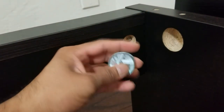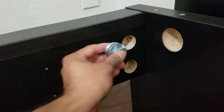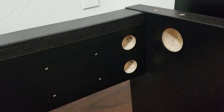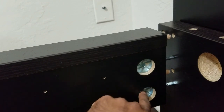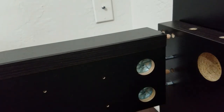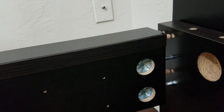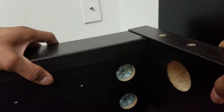The next step involves the pinwheels. The way you need to put them in is with the arrow facing towards you, and they need to go flush in. The arrow should line up with the screw right there. This is the arrow, and it is going to be lining up with the screw. The concept is it gets connected here, and when you tighten it, it goes along the grooves and tightens up. To tighten it, you need to use one of the allen keys provided. I forgot to put these in — I had to push it out easily since nothing had tightened yet. The arrows are going to be facing towards the screw, lining up perfectly. Push them in as much as you can, but there should be a little lip. Once that's done, push the entire assembly through and you should hear them click.